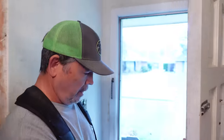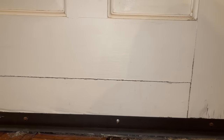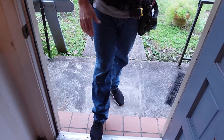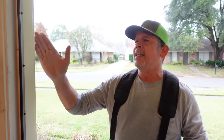When your friends and family come over, the first thing they see is the front door. Maybe you're embarrassed about your front door. Doors take a lot of abuse. On this particular front door, the bottom rail is all cracked. I've seen them where they're rotten, and we've all seen where the door jamb gets rotten at the bottom. Also on this door, the weather stripping is all dried out, it's cracked, and the threshold is absolutely trash. We're going to show you how to change all that with common tools. Make sure you stay tuned for the whole video, because we're going to show you how to do it and maintain the exterior casing — we're not going to remove it at all, so we don't have to run caulk between the casing and the brick, and you get to save that doorbell.